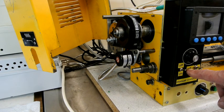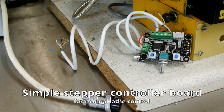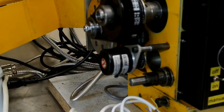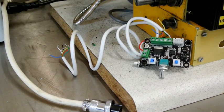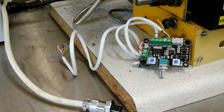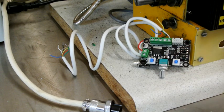Tucked away just here are the controls for the manual side of the lathe. This is the board contained behind the back — inside here is one of these little boards. They're a very cheap stepper motor controller which gives you manual control. There's an on/off switch on one side, a switch that changes direction on the other side, and a variable speed potentiometer. I took out the controls with extension wires that feed these manual switches here, which makes it slightly easier to control, and I can easily replace the switches if they ever need doing.